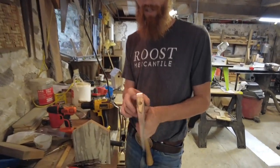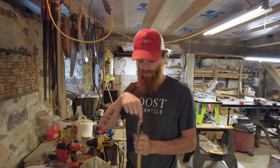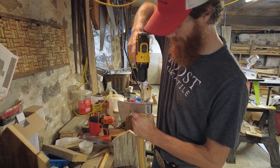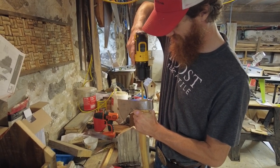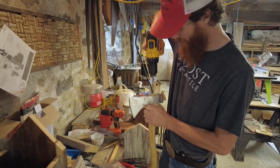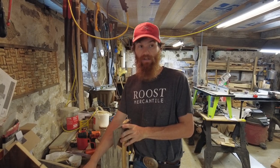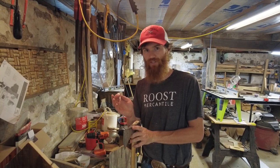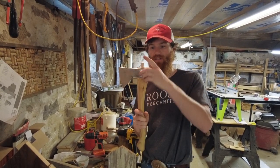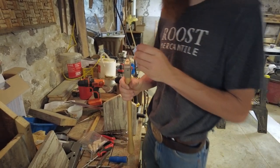With this Hudson Bay, the wedge is actually bigger than three-eighths across where the steel wedge was, so we're going to have to drill down inside there and drill it out to three-eighths, then set that maple wedge in there. A lot of folks think these need a tapered hole, but in reality it would be like cutting a tapered curve in an axe handle — you wouldn't want that. You want the hole walls to be square because the wedge itself is tapered. So the wedge is in there — it's a little bigger on top, but since it's tapered it's going to fill that out.